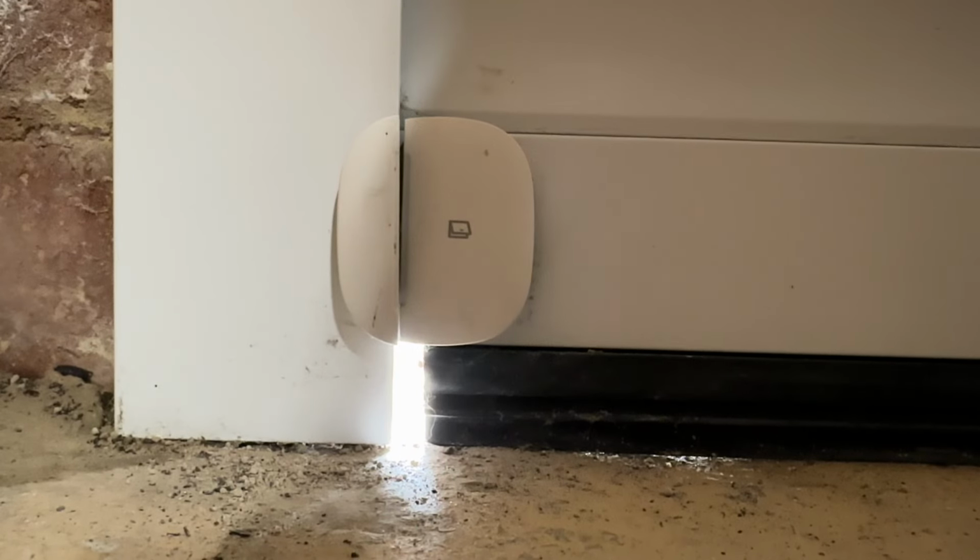The basic concept behind making a motorized garage door smart requires two things. Firstly, you need some way to know whether the door is open or closed. In my homemade solution, I used a regular wireless Zigbee contact sensor. Then you need some way to close a circuit, so a remote controlled switch or relay that connects into your existing garage door controller's push button terminals.